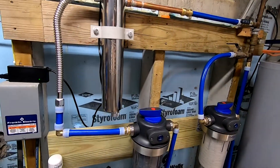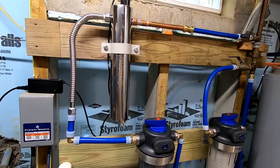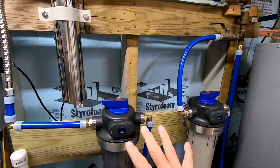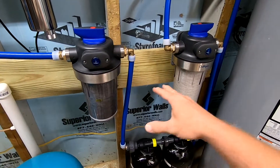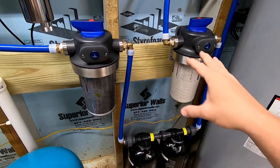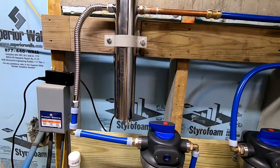Only clean and filtered water should be put through the UV sanitizer. And the reason is if you put any one of these components after the UV filter, there's a chance that some sort of bacteria or mold could grow in one of those systems, and then it would have no effect from the UV.